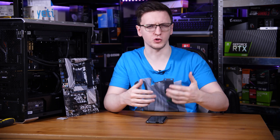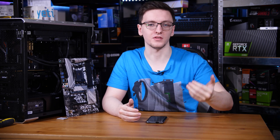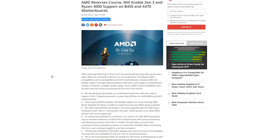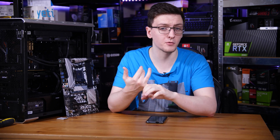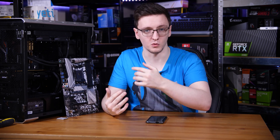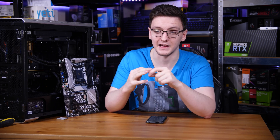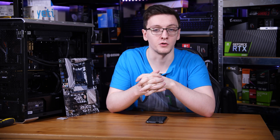Now, there are a few things that you need to know before you go and update your own board. AMD claim that by upgrading to these new BIOS versions, it is irreversible and that it won't support first or second generation Ryzen CPUs anymore, forever after. So you have to make sure that you have a third or fifth gen CPU ready, and you have to assume that you will have no support from AMD or your motherboard vendor. Even if you still have warranties, you can probably assume that they might not honor them. That's the disclaimer.